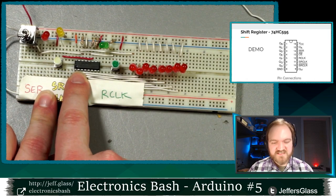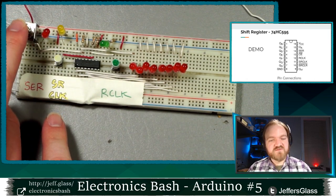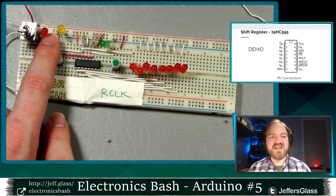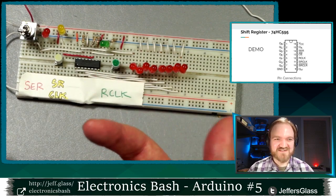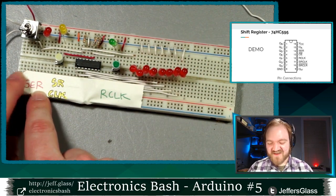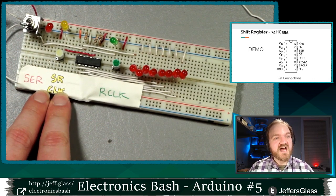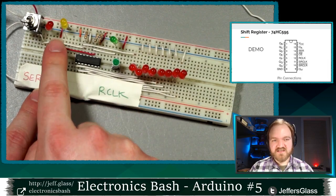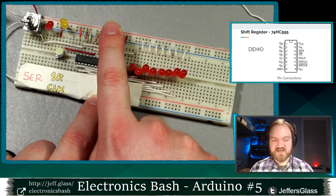So I have my pins here, and I have switches or buttons hooked up to my serial data input here. It's going to have a red LED attached to it. I've attached little colored LEDs to these things so you can see what's turned on and what's turned off. I think that'll make it a little bit easier to understand what's going on. So I have my serial data line hooked up to this switch here. I have my serial clock line hooked up to this yellow button and this yellow LED. And I have my latch, my R clock, hooked up to this green button and this green LED.